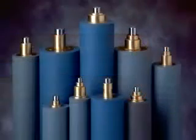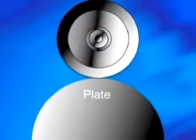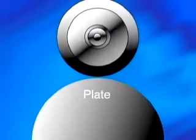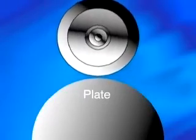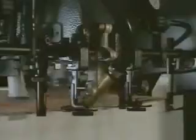The best reason to always buy new core and cover whenever possible is the guarantee that the roller will run true. If you set the roller on the high side and it is out enough, this will result in winking. Being out by 3/1000ths is common on used roller cores. We've seen them out as much as 8/1000ths of an inch. Of course, if you are running your press at only 5,000 impressions per hour, don't be too concerned. However, if you are a high-speed printer, concentricity is essential to you.